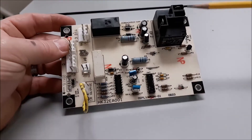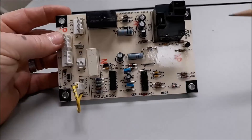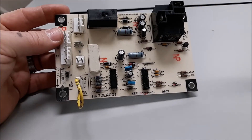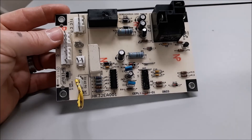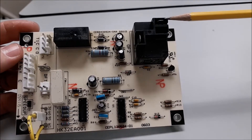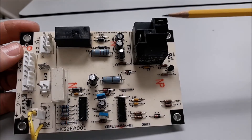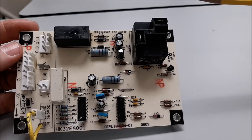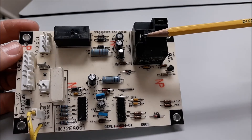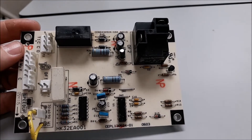Like with a lot of circuit boards, you've got this big bulky relay just sitting there. One guy asked me why this one only has two connection points, but the fan board for Goodman has three. This is a different relay. Since it's used only to cut power off for the outdoor fan while we're going into defrost, we've got a simple switch — a normally closed going to a common connection. Once we do defrost, that's going to open up and cut the outdoor fan off.